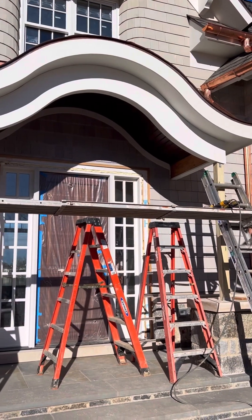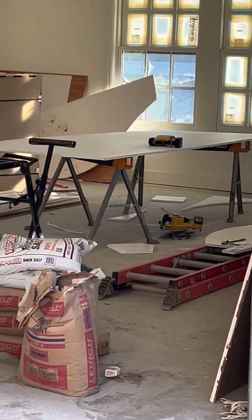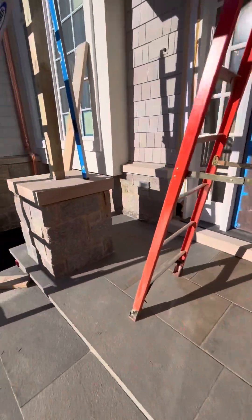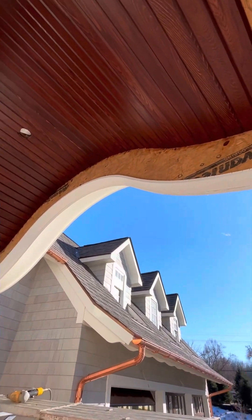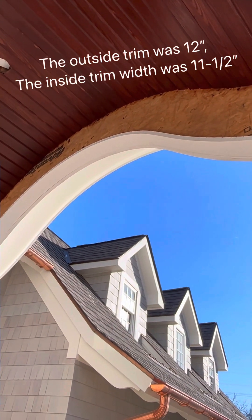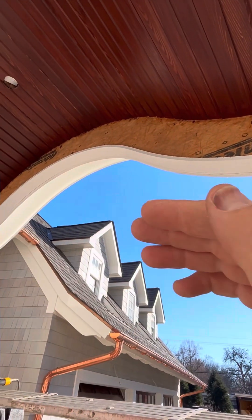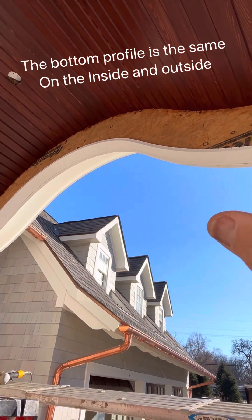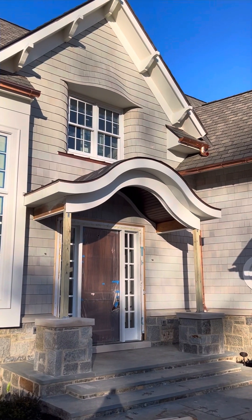Complete profile cut — there she is. I've taken that piece and scribed it onto my next panel, because I've got to do the inside as well. However, there's tongue and groove on there so this is a different width. I'm just going to use the bottom profile, measure up the width I need, and basically do the opposite of last time. Last time I cut the top profile and scribed the bottom with a gauge block; this time I'll use the bottom profile since I know it's already good, and scribe the legs for the top.